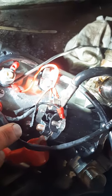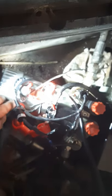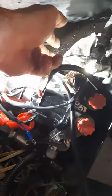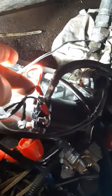There's four terminals back here. We'll start with the positive — there's positive right there. This is my positive side of my motor and positive side of the relay, and negative side of the motor. My negative is going off to the negative side of the battery and to the ground on my frame. We got the positive side here going to my battery cable — battery positive side down to the backside of the relay.